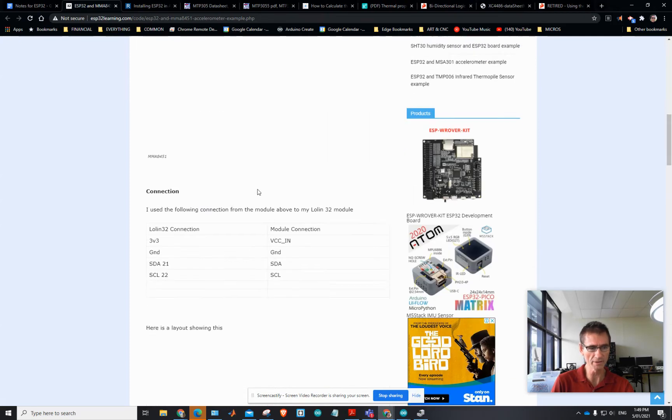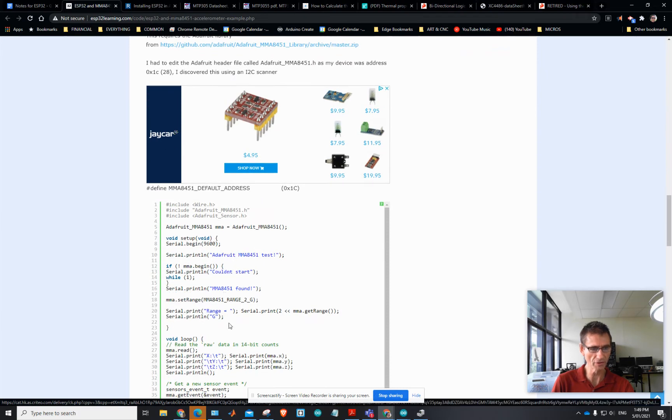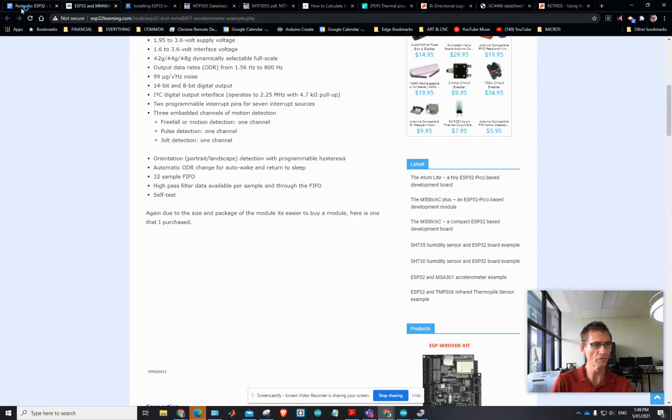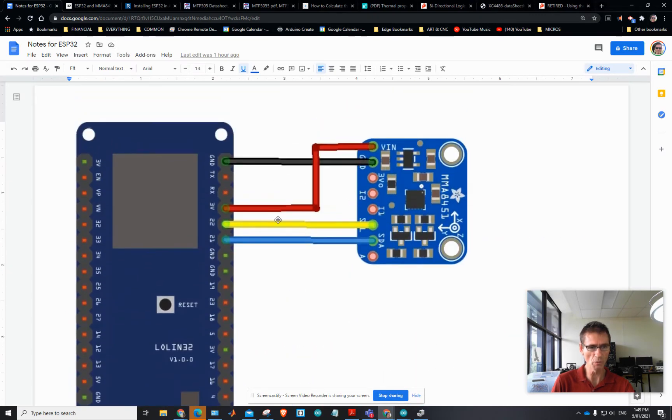There's a picture here but I don't know why it's not showing up in my browser. There was a layout and here's the code, so I've used this as a reference — credit where credit's due. The diagram I pulled into my notes doesn't actually work, because with 3.3 volts going into the voltage regulator, it won't regulate properly — you usually need at least one and a half volts difference between input and output for a regulator to work.